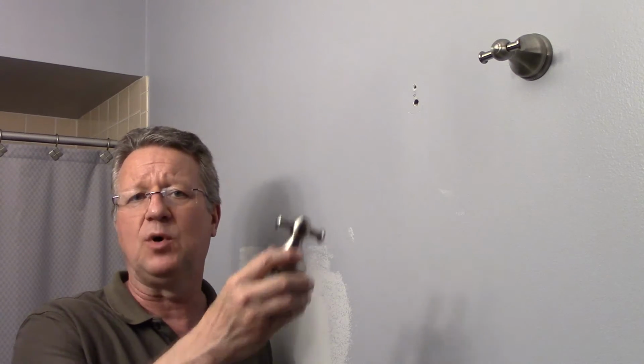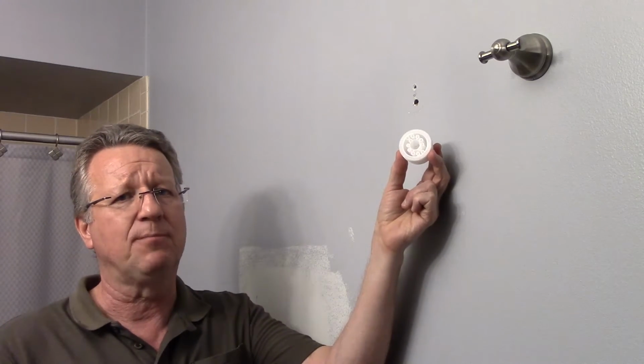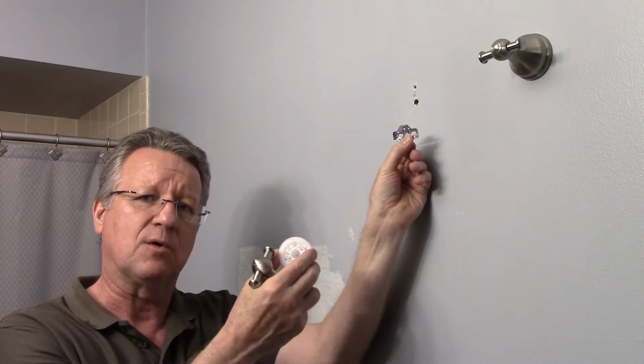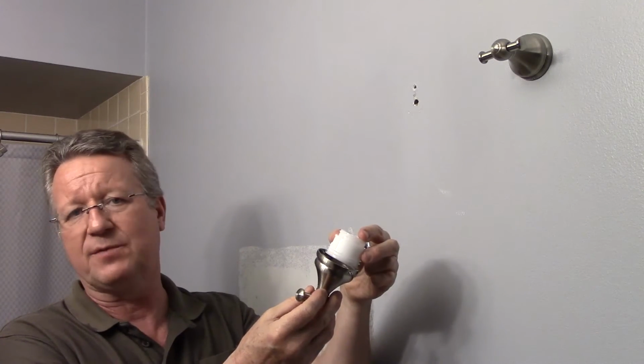I have a towel hook that pulled off the wall. The plastic anchors weren't strong enough to carry the weight. I'm going to be using a WallShark plug to support the bracket. And this is designed to hold the bracket for a towel hook or a towel bar. Your towel hook or towel bar needs to have at least a 2-inch diameter to cover the plug.